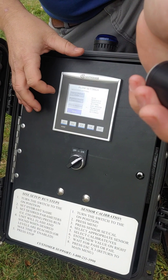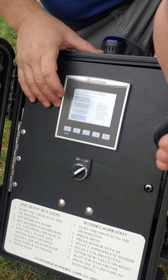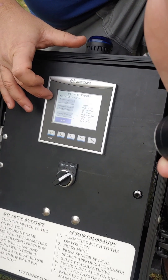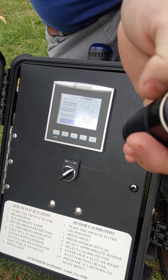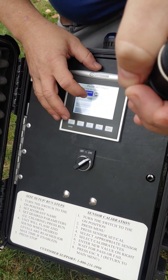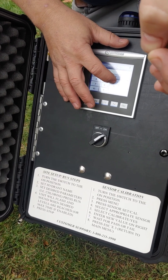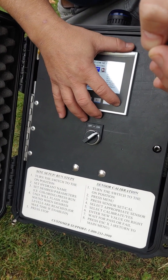Flow settings — we don't have to flush until we get 0.2 out of that hydrant barrel. You can guess on your flow rate and it'll totalize the gallons used, or if you only use one style hydrant, it's called 1460. 1460 out of two and a half? Yeah — that's a 60 GPM style.